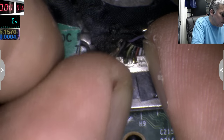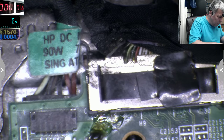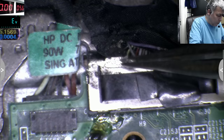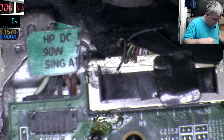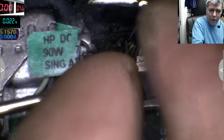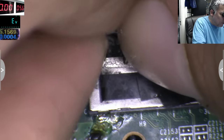Yes. No, oh, I did have a 00 reading. Give me a second. Let's check again. So this one and this one. And check on the multimeter, it's 0-0. Yeah? So these wires are together. These are 19 volts. They are both meant to carry 19 volts on the top, on the screen.